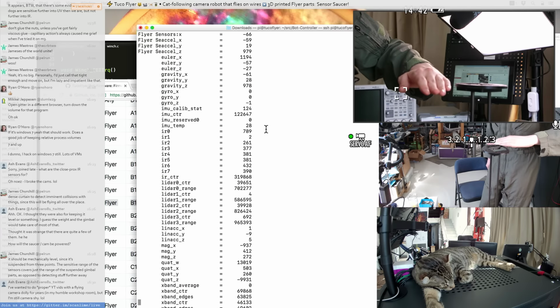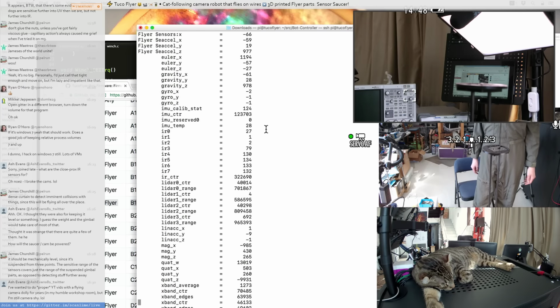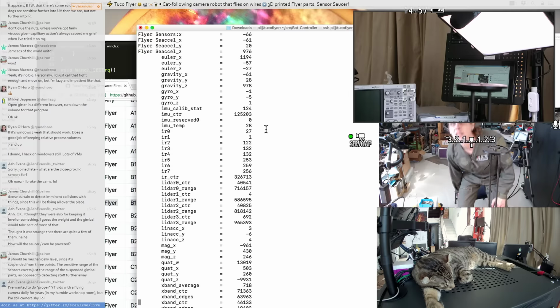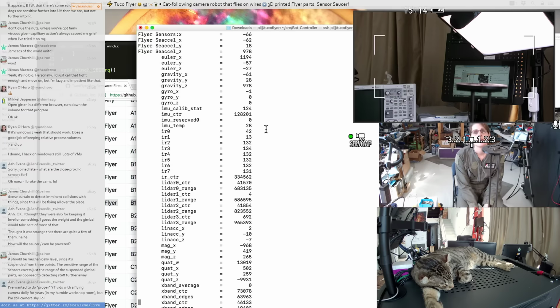I'd really like to get this data graphed. I'm still trying to figure out what the software stack I want to use for that is. I think one of the next steps is I actually start trying to build the server that runs the robot. So right now the robot's a pile of microcontrollers that talk over Ethernet, over UDP. And the microcontrollers don't really do much. They just do the really low-level hardware interfacing. I'll have a PC doing the actual computer vision and higher level tasks, and then that's also a convenient place to run the middle levels, like the higher level motion control stuff that is not quite as latency sensitive, but is stuff that I'll want to edit a lot. That stuff goes in the PC.